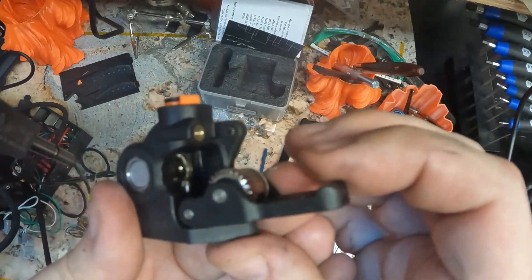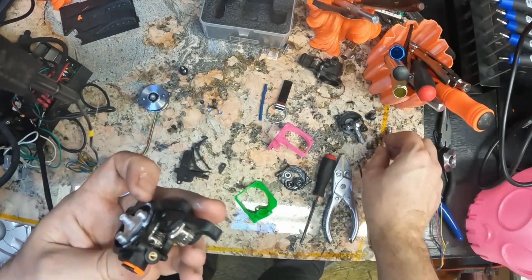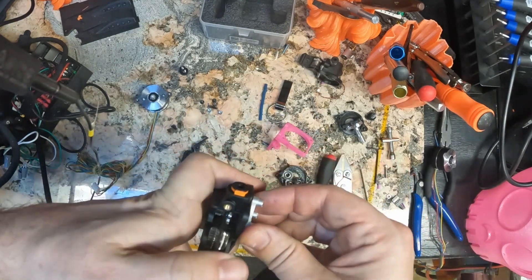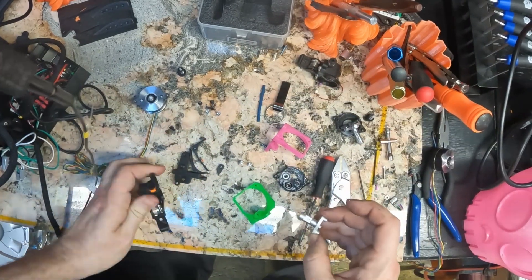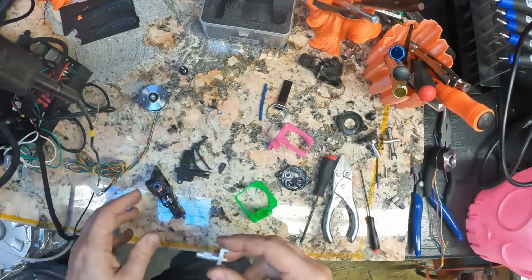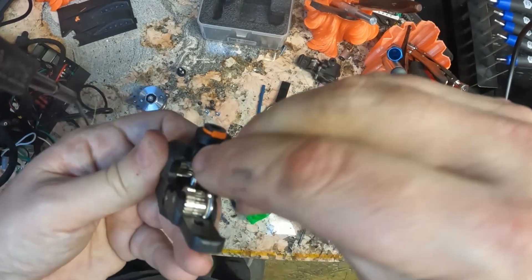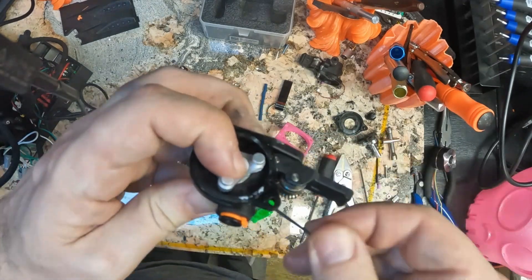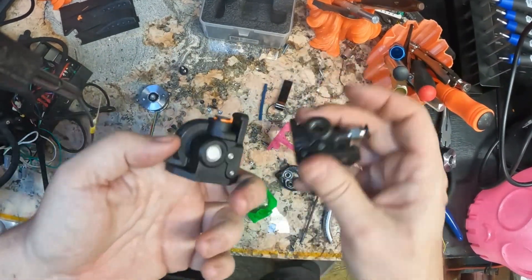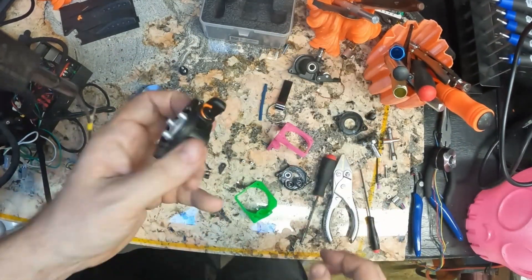In terms of the filament path there's not a lot of guide at the start. Looking at the gear assembly pulled out: it's using smaller set screws now with a notch in there. The entire thing has shrunk quite a bit from shortening the gears and turning them around, so the unit has lost a good bit of weight. Everything is torqued down quite high with brass inserts, and even the housing looks like it's been shaved down a little bit.